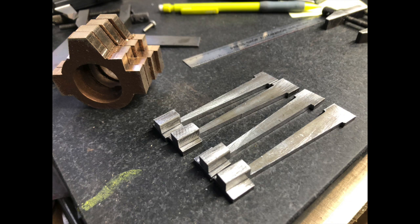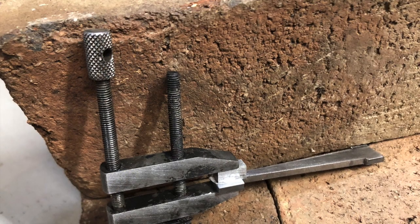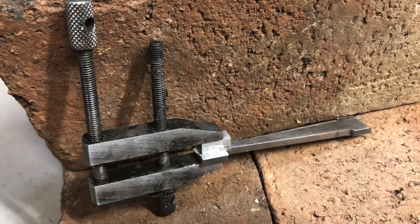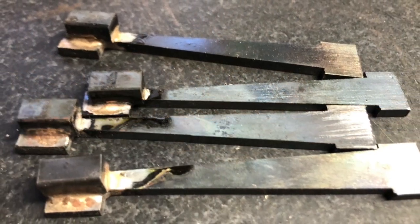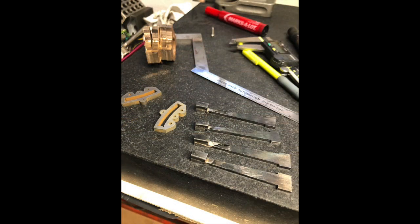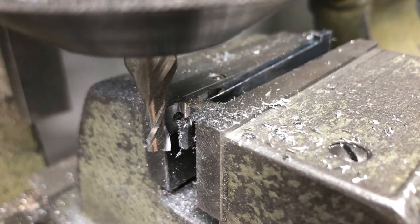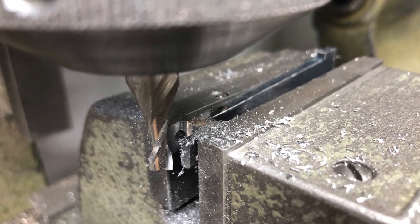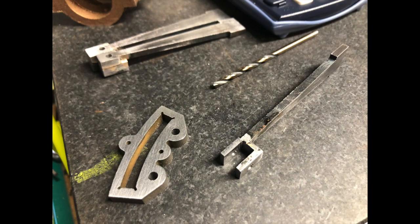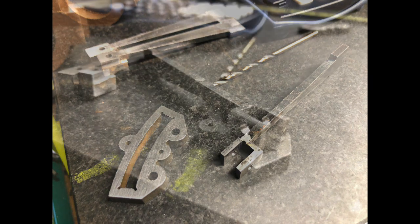I did a little bit of research online to determine how to best tackle the four bronze castings for the eccentric straps, and wanted to try and do them in a manner that was as efficient and as accurate as far as repeatability goes — to get commonality for those four castings and get them more dimensionally similar. I achieved that effectively by machining a datum and then keeping them together as a set, rotating them around in the mill to machine up to the external dimensions, which need to be consistent for all four to look representative of the prototypical eccentric strap.